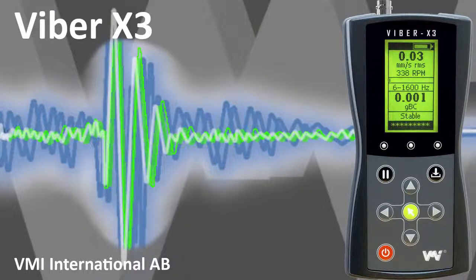Welcome to VMI's instructional video for the Viper X3, our lightweight, cost-effective, digital handheld machine condition analyzer, which we recommend using to check for excessive vibration and temperatures in machinery at regular intervals, and to aid technicians during fault analysis and corrective maintenance. Using the Viper X3 with Trendview Software allows users to collect, save, and monitor machine condition data so preventative maintenance can occur instead of costly equipment breakdowns.